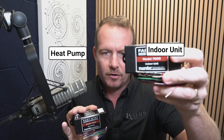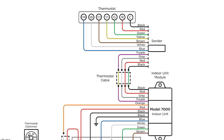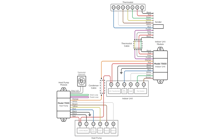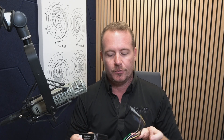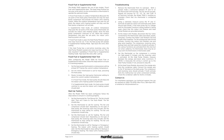Here we have the heat pump side and the indoor unit fan coil or air handler. On the indoor unit side, black, red, gray, and purple connect back going to your thermostat, and it creates all the conductors on the other side that connect to your air handling unit. For the outdoor unit, it's designed to run on only two conductors — orange and red — those are the only two you connect. Once you're done wiring, there's an adhesive patch to attach it inside the unit. There are also options involving auxiliary heat or fossil fuels, described in the instructions. This gives you the ability to install any 24-volt wired heat pump system using only two conductors from inside to outside and four conductors from your thermostat to your air handler or fan coil.